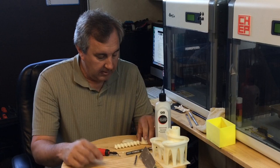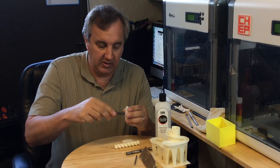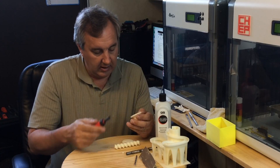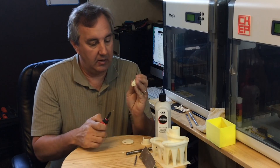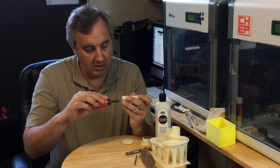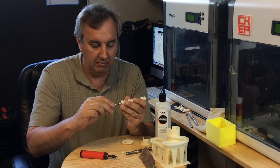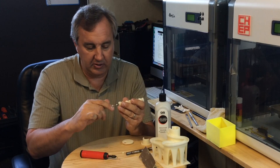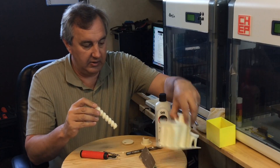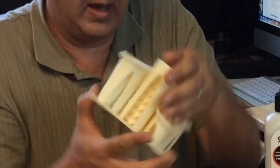To clean these up, first I had to get rid of that bottom flattened-out edge, and that's where this finishing tool works great — it just pivots and cleans that stuff right off. I'll put a link to it. Then for the hole at the bottom of the screw mechanism, I clean that off the same way. I found a drill bit the same size and hand-spun it to clean out all the little extra plastic ribs around the hole. I tested it on the pin and it slid perfectly and spins really easy.